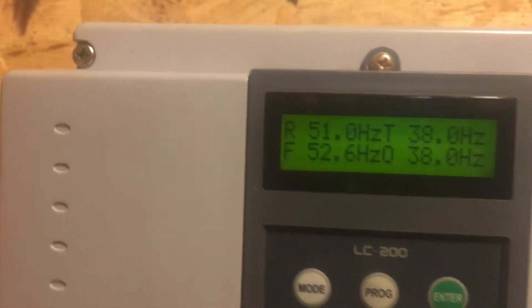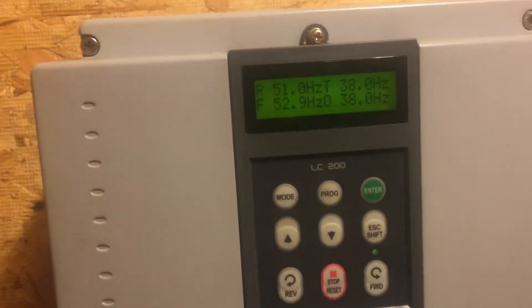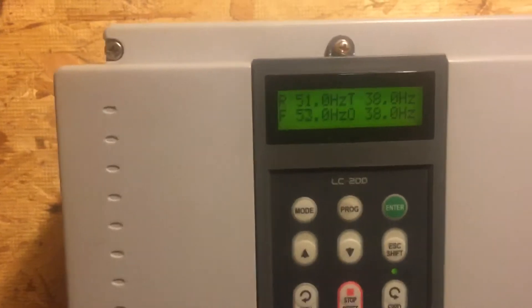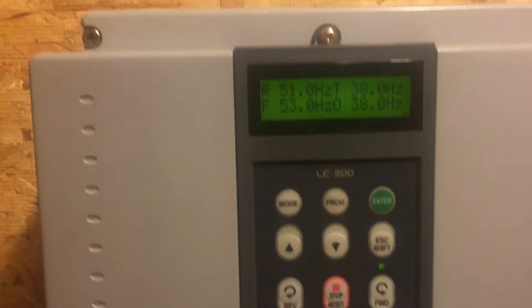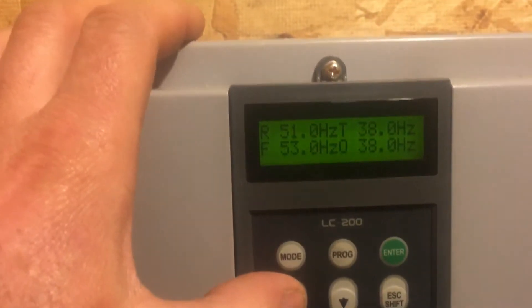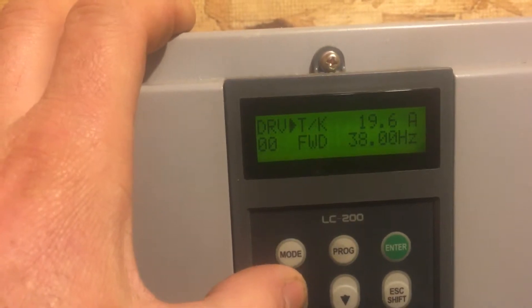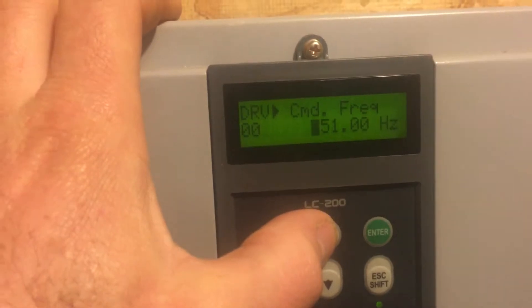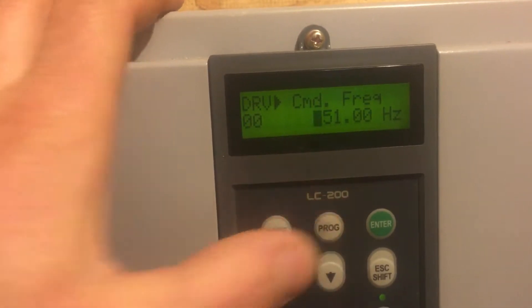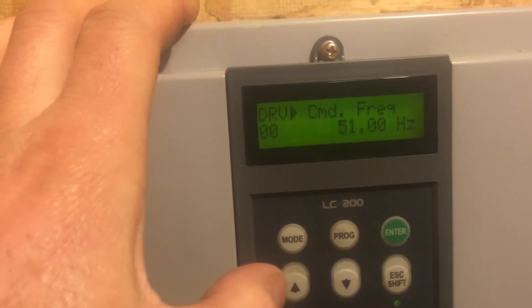What that valve does is let air into the pump so it isn't grinding away with too much vacuum. It doesn't happen too often but sometimes it will. This main screen is the one I use most days. Going into the next screen is where I can change things — go to program and that's my set point right there, and that's how I adjust it with the arrows.